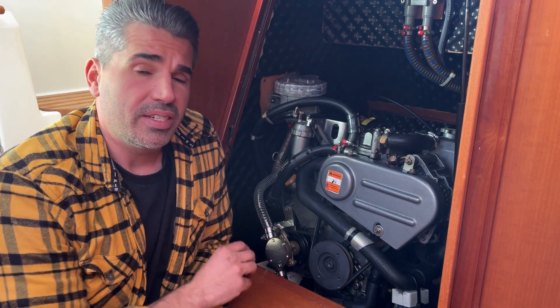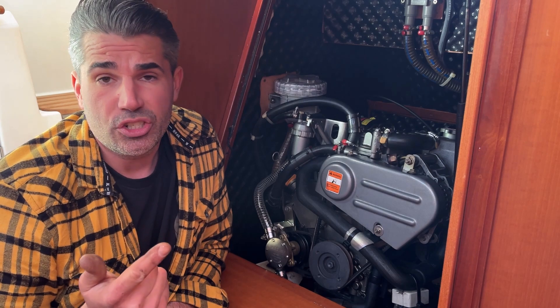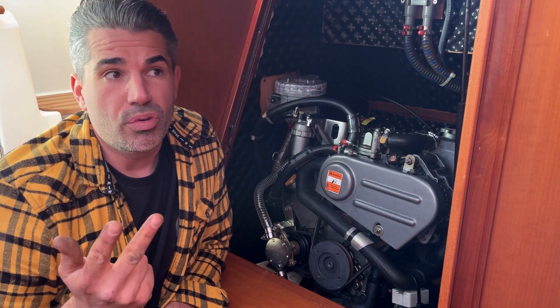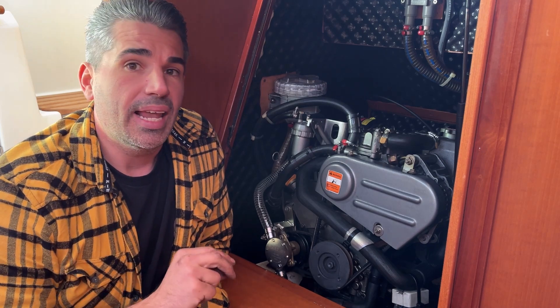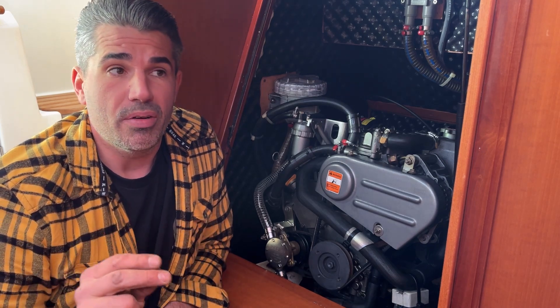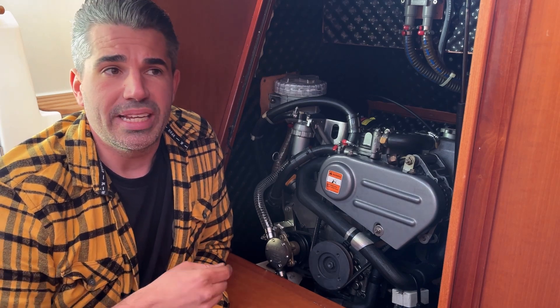When I stripped off the old unit I could see that the drive shaft had scratches in it, the water pump impeller needed changing, and the seal is the reason why all those other things failed — because as soon as the seal went it allowed salt water to pass into the bearings as well as on the shaft, causing a lot of corrosion and that is why the leak happened.